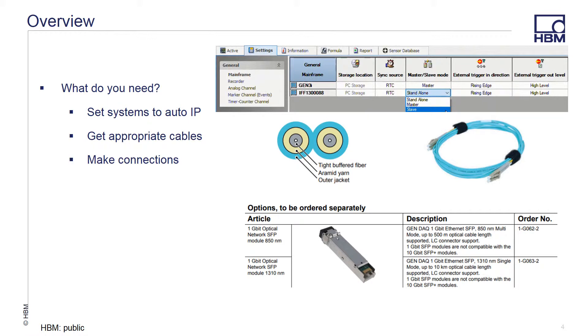A network cable is required to connect the two PTP-enabled Ethernet ports to each other. The system comes standard with a copper RJ45 Ethernet port, and you can use that to communicate with each system, or obtain an appropriate SFP module to plug into the optical PTP port for communication if the distance between the two frames is too far apart for copper. The optical Ethernet port will support either a single or multi-mode fiber — you just need to make certain that both have the same style port.